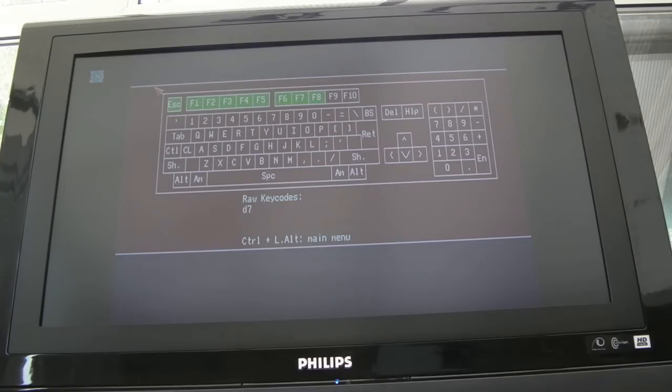I think we have. So the membrane might be part of the issue with the columns, because obviously I've reseated it a few times here. But it would seem that the red screen is absolutely tied into the behaviour with the keyboard. What we do know is, well, the CIA must be fine. You can't have a CIA that causes a red screen one second, and then when you power it off and on, leave it for long enough, then it's all right, etc., etc. So this is a really ruddy mysterious behaviour.